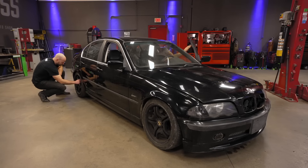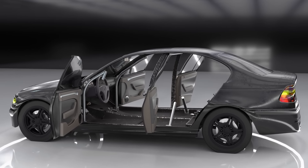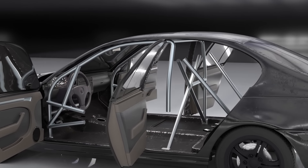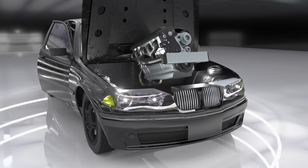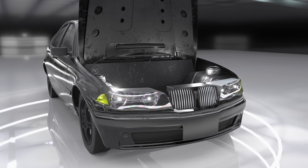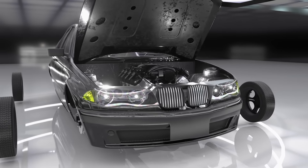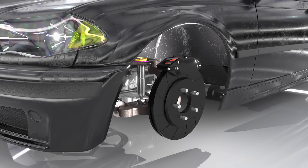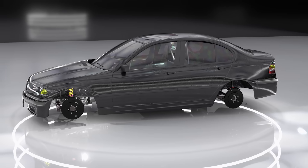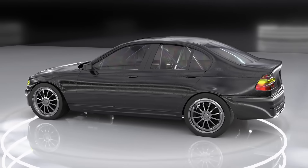This car is a handful of work, but let me tell you how we're going to get it done. Just like with all of our race cars, the first thing we're going to do is gut the interior so we can make way for a true race-specific roll cage to stiffen up the car and keep us safe. We'll also slap in a pair of racing seats. Up front, we'll tear out the stock inline-six and manual trans and swap it out for a mildly-built LS and a five-speed transmission. The stock brakes will come off and get upgraded to something more useful on the track, along with some coil-over shocks all the way around. An aftermarket set of wheels and racing slicks will make sure the BMW sticks to the track and looks good doing it.